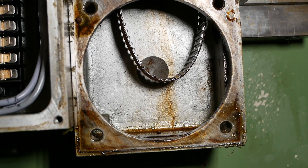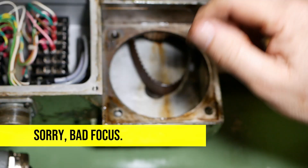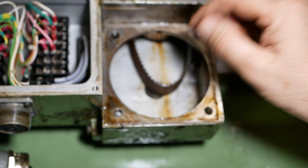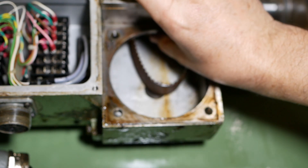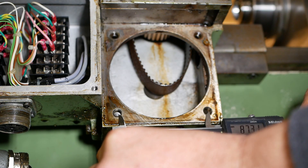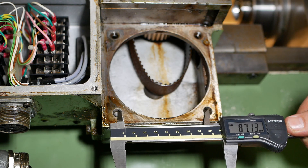So once again we've got another belt drive, pretty much the same. I was hoping to just turn the ball screws by hand and move each axis, but it just feels too stuck. I wonder what this bolt pitch is — the centre of those are 87mm apart, which is kind of a pain. I think most of the modern motors are 90mm.